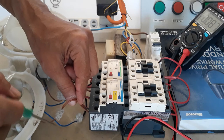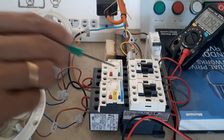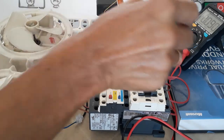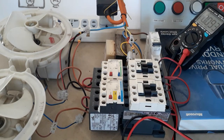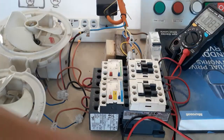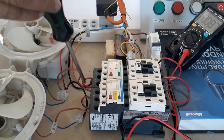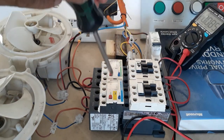That is a very simple power diagram. It will go to my motor line leads. All you need to do first is loosen all the terminals. We will be using the power terminals of the overload and the power terminals of the contactor. Loosen everything, then connect the wires one by one. From the outgoing, connect a wire there, then if you are going to share it to the next contactor, make another wire and insert it, then tighten up using your screwdriver. Connect a cable here, do a jumper, and that is how you do the power diagram.